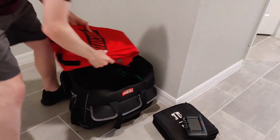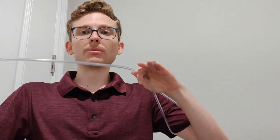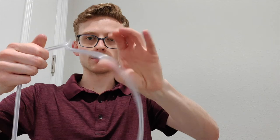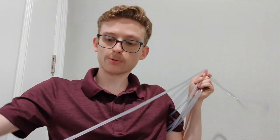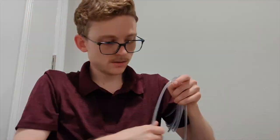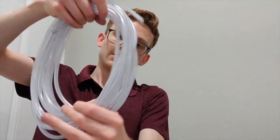My secret to keeping the hose free of tangles: I wrap it around my arm, but on the wrapping hand I keep an open circle instead of a closed fist. If I force my hand closed, the hose goes wherever my hand goes and will start to twist and untwist on you. By keeping an open ring and letting gravity kind of unwind the hose ahead of me, I avoid that. Use gravity to get some of that twist out, and you end up with a nice round coil. If you don't do this you end up with hoses that are a tangled mess.